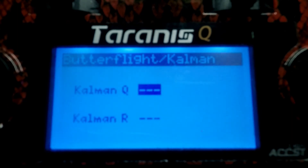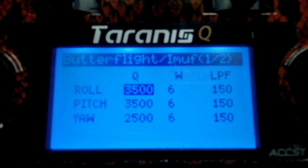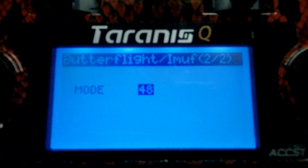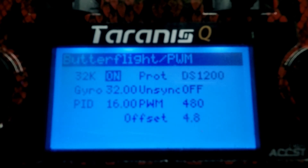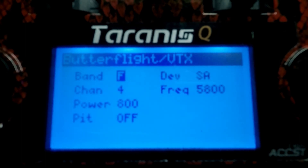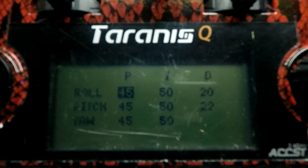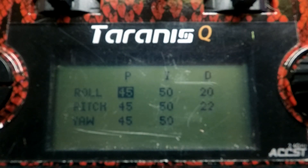You can do your setpoint weight, and then you have your low pass filter you can change, and then gyro and D-term filters. If you're running the Kalman you can do that — since I have the Helio board I'm using the IMUF and I can access all those settings right there, which will be really handy for the next video I want to do about tuning this quad. There's also a mode for the IMUF, and you have where you can set your PID loops, even your DSHOT 1200 or DSHOT 600 protocol, and then your VTX settings. That's pretty much how you set up the Butterflight Lua script on your Taranis — I hope you found this video informative. There are a lot of neat features on here that can save yourself some time configuring. I appreciate you guys watching, I'll see you guys again — peace.